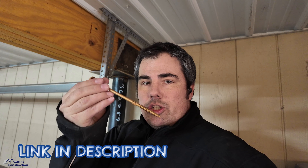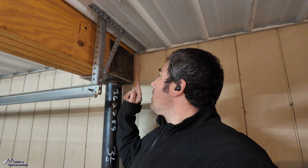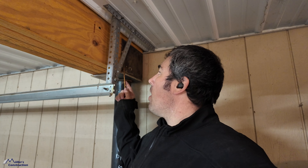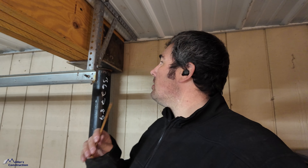Time to start putting in our fasteners. We've got a schedule laid out for us from U2 Fasteners. We're using these giant six-and-three-quarter inch long by three-eighths thick construction screws — these are structurally rated. We just have to put them in according to the U2 Fasteners schedule. They've told us how many we need to put in this beam and the exact locations. But first, we've got four holes drilled in our post bracket here, with one little screw in it just holding everything steady. We're going to drive all of these in and then start with our fastener schedule.